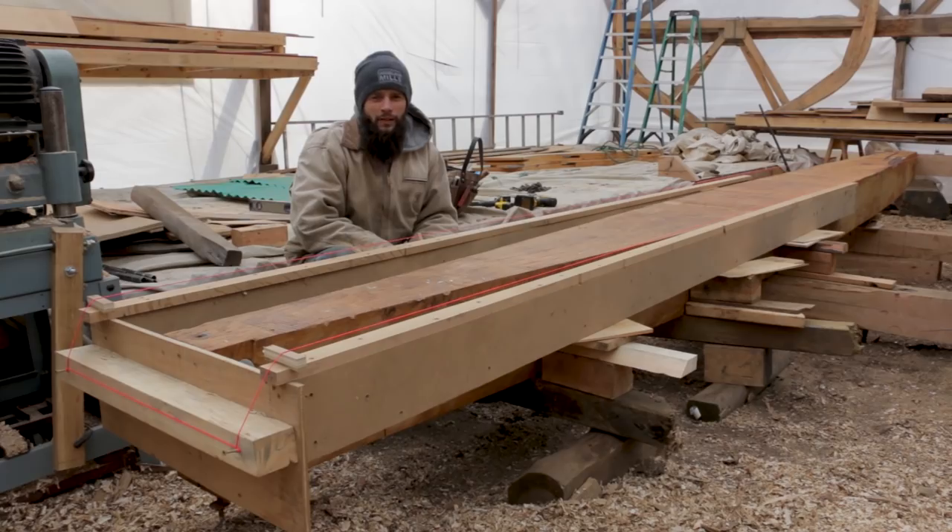We were working on the ballast keel and got to the point where we need to set up the rails and flatten the top, but we realized we were going to create a lot of lead dust doing that — probably the highest risk of exposure during this whole process. So we ordered some more safety gear: a full face respirator and some other stuff. While we wait for that to come in, we're going to move on to the next step and work on thicknessing and flattening the keel timber.